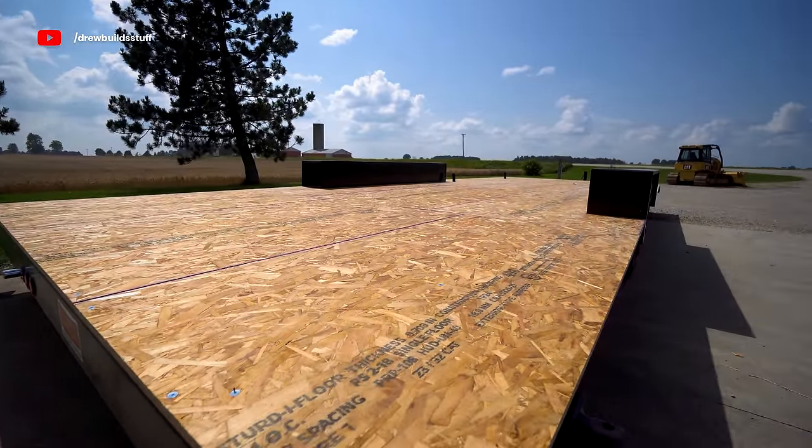Then I just brought that corner post over onto the corner of my tiny house and lined it up with my chalk lines on each side. I'd use a roofing nail, and the first nail I'd put at the very top of this nailing slot. This just holds the post up tight against the soffit and allows any expansion to expand downwards. And then all the rest of the nails I put right in the center of the slot.